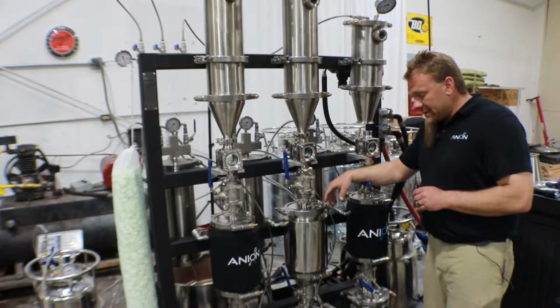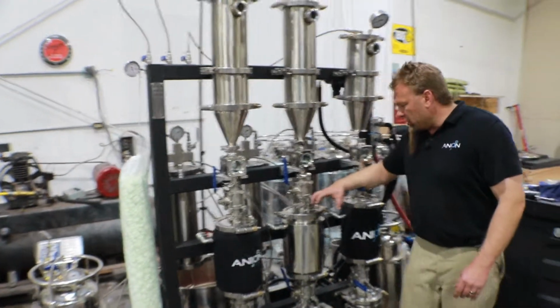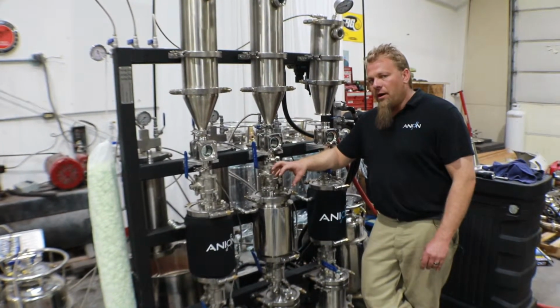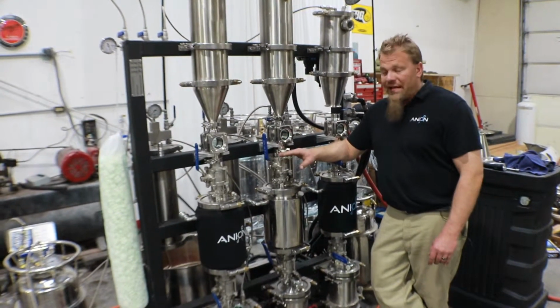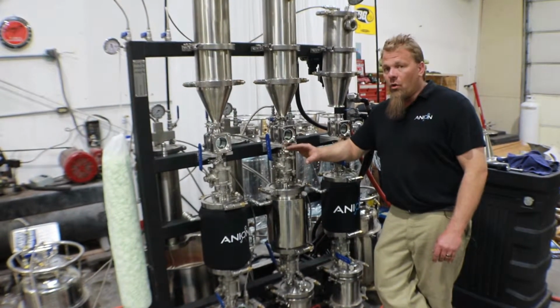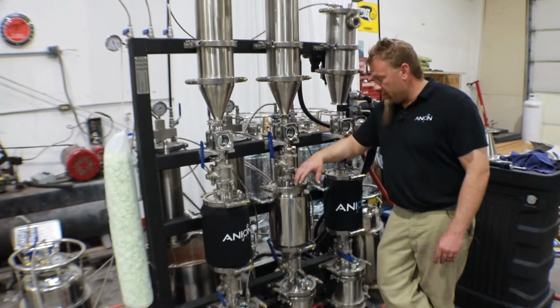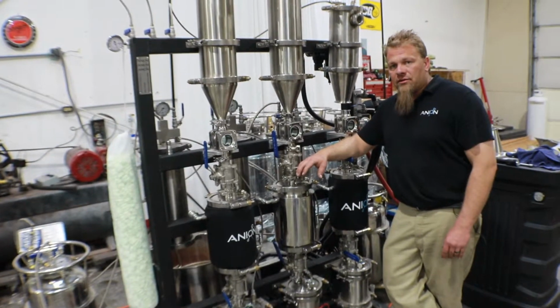Like I said, obviously it is a little bit faster. Surprisingly, we thought it'd be a lot faster than that, but looking at it, the displacement on it is relatively small compared to the Goliath pump, but it does have a much faster cycling rate. So we can see it does pull down deeper into vacuum, and it is recovering faster than the Goliath pump is. But nonetheless, looks like it's a damn good pump. So I think we'll add that to our revision so we can use it here in the future.